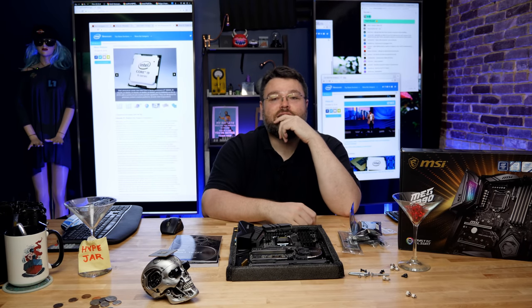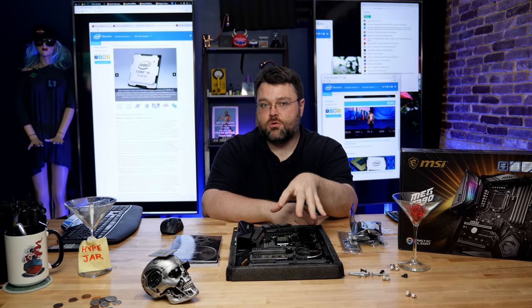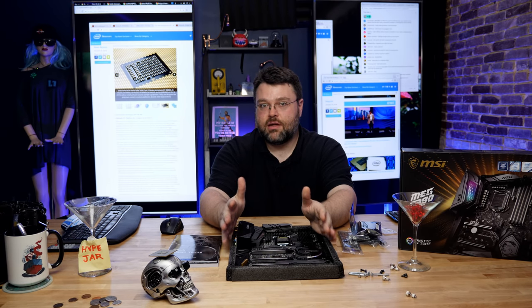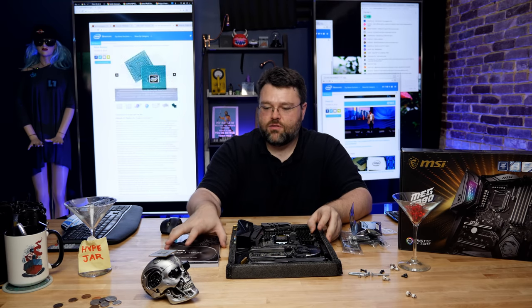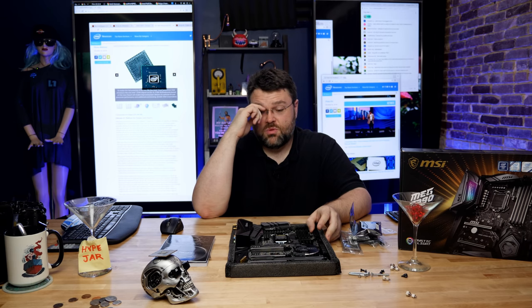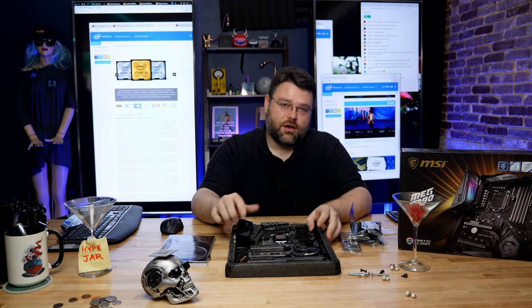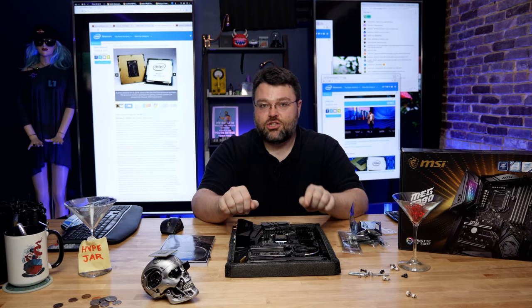Like, this is different. Most of the motherboards for the Z370 use the DMI lanes. This is really crucial. There's a story being told here. So if we see this pattern on other Z390 motherboards where they're splitting up the PCI Express lanes like this, then we know that the board engineers agree with me, finally, that it's crazy to route all of this PCI Express connectivity through the chipset.